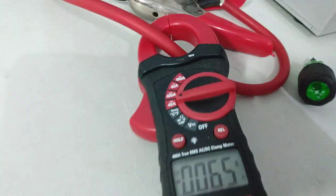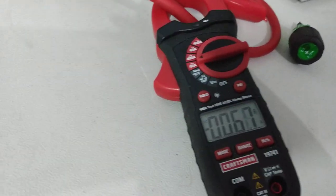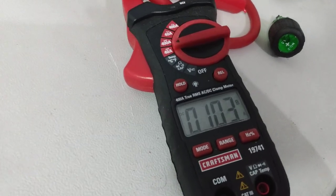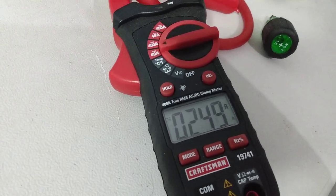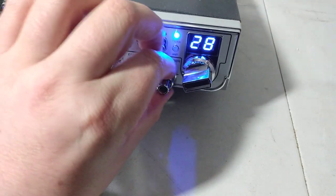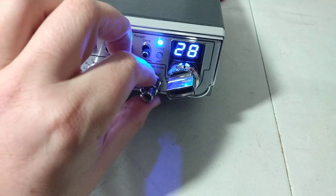We've got the RF power all the way down. We're going to come over here and we're on the right scale. So, we'll just give it a good audio, RF power all the way down. Audio, 2.5 amps. Now, all I'm gonna do, guys, I'm gonna turn the RF power wide open.